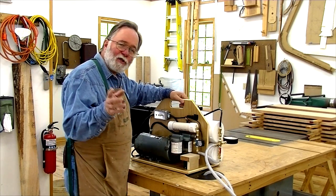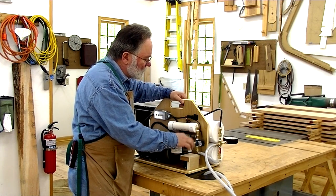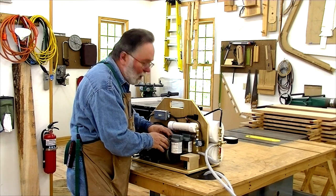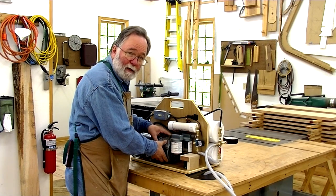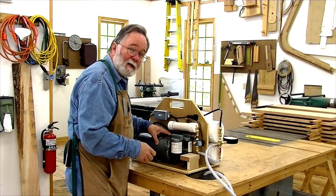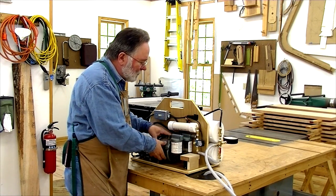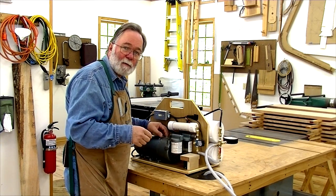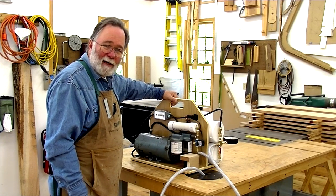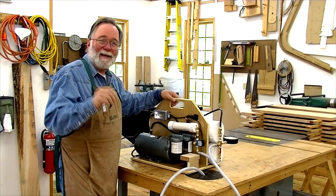There we go. When it shut off, the pressure switch detected sufficient vacuum and cut power to the relay, which cut off the pump. The MAC valve shut, the system was allowed to blow off its vacuum through this little breather here, so now the pump is just sitting at atmospheric pressure. When the system starts up again, the MAC valve will open but the check valve will stay shut until the pump draws sufficient vacuum. That's what this little auxiliary sub-reservoir is for — to give a little volume that the pump can draw on so it doesn't immediately start up under full load, letting the pump come up to speed before it really has to suck vacuum on the reservoirs. Works great, just like advertised. In the next series of videos I'm going to be using this to do some vacuum hold downs for the CNC machine, so I hope you tune in — thanks for watching.